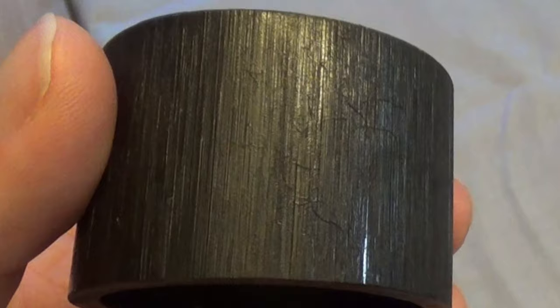But I do really like this technique of using the textured plastic. So what I did was I just went over it and made sure that there was texture every place. And basically the little sand fibers, the grip fibers, they're little knives, and they cut a little piece of the plastic out, kind of like a wood fiber you'd cut out if you were using a shaver, a spoke shave or something like that, or a scraper. And that had to be sort of sanded off just so you could get rid of those hairs.